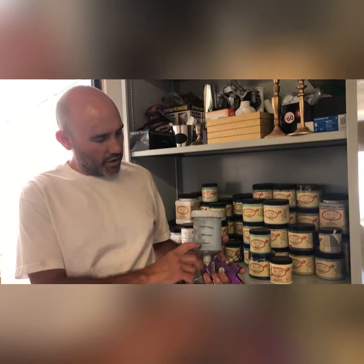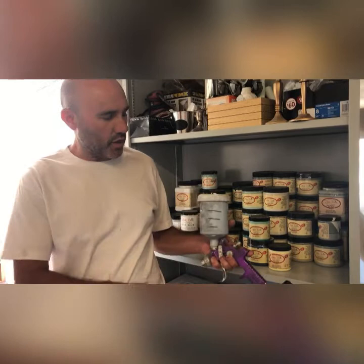Okay guys, so I got my spray gun here and I got my Antebellum Blue loaded up in there. On the canister, it'll give you the 5, 10, and 15 ounce marks, so we just Sharpie those to make sure we can see them well. If you use 10 ounces of paint, we like to thin it out a little bit with water, so do 3.5 ounces of water. If you're going 15 ounces of paint, we like to put 5 ounces of water in there.